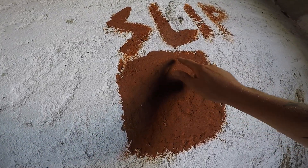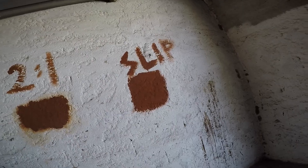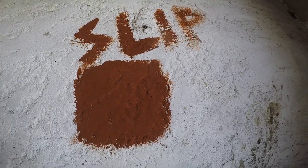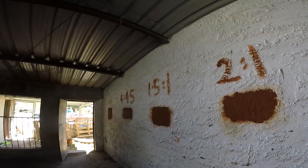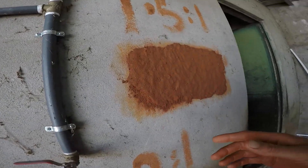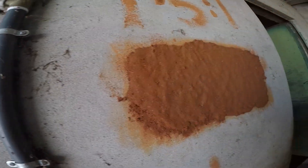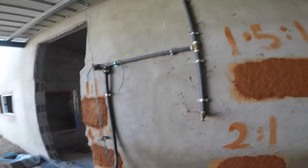We made a little test just painting directly with slip — fine filtered clay with water — on the painted wall, just to see how it looks. Maybe they'll end up just doing a paint on there because it's already been rendered; it's not totally smooth but not really rough either. If these mixes don't really stick very well, we can just do a paint on that particular part. Then there's the outside space, which is a smooth cement render — not ideal, probably the second worst of the four to work onto because there are no keys, though it is semi-absorbent so it might be okay.